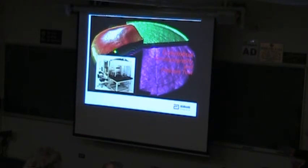And there's a number of different ways to look at it. There's the overall bow and warp, which really doesn't show up on here. That's one feature. There's an overall thickness variation. You can see this wafer is thicker in the middle, actually, than it is at the edges. There's detailed structure of this at a fine level. There's edge effects. And then, as you are actually exposing these with photolithography, they're done in a scanner system. So the wafer is actually moving underneath the lens in a strip. So you don't really care about the whole wafer. You just care about the metrology of that little strip. And so it's actually useful to be able to analyze this in terms of what the performance is across each individual strip. And this is all real data off of a Shack-Hartmann scanning tool that we built.